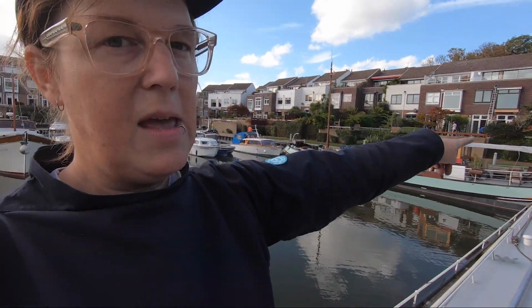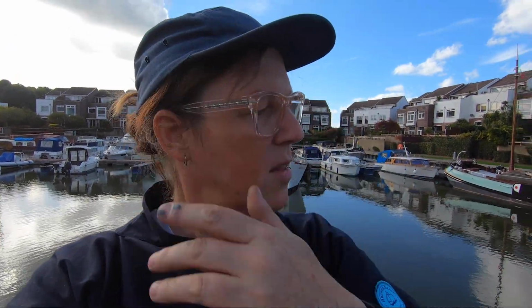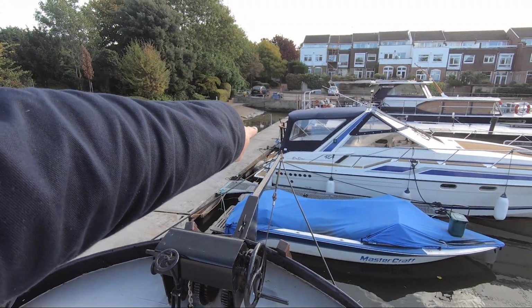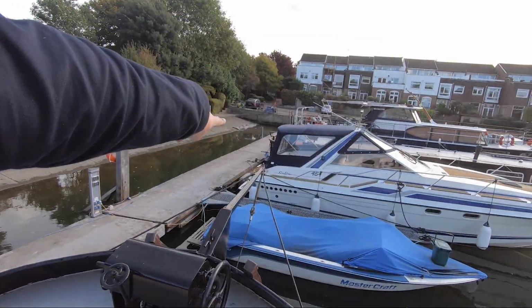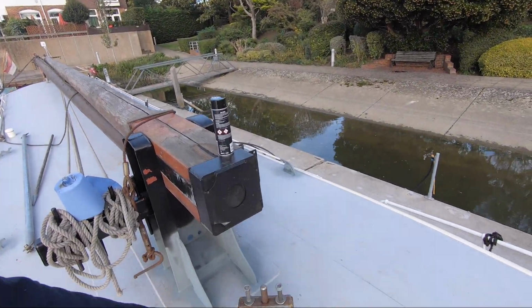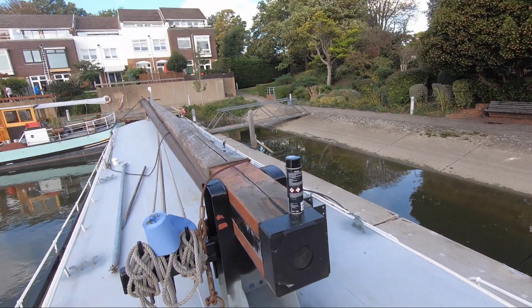The way that the mast is going to be raised is that there will be a cable, like a halyard, I suppose. There'll be a second forestay, which is the cable that runs down the front from the mast to the bow. Usually there is a forestay, and that's this thing, and this thing connects to the end of the bowsprit there. I always say bowsprit, but it's a bowsprit, of course, because it's from the bow. Anyway, I think it's a family thing. We always used to call it a bowsprit for some reason. Anyway, so it gets connected onto there, and then that supports the mast up there, and also this wedge will keep the mast from moving a bit as well.